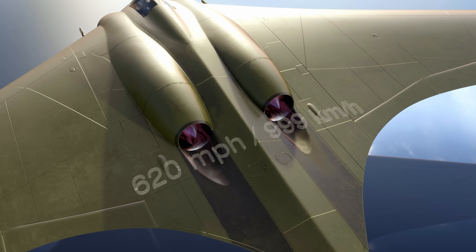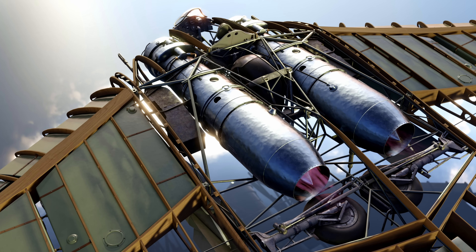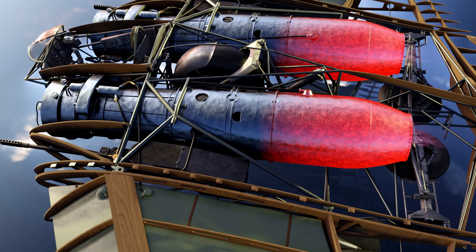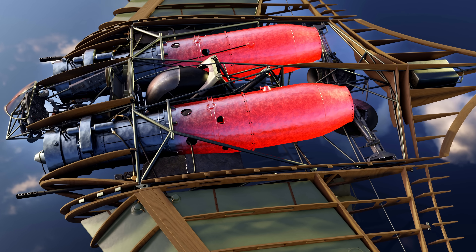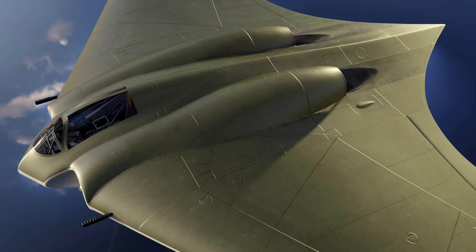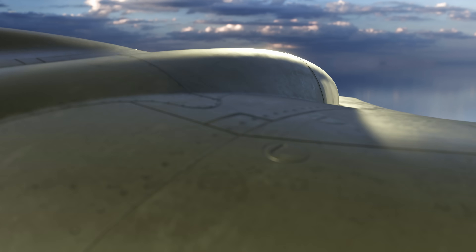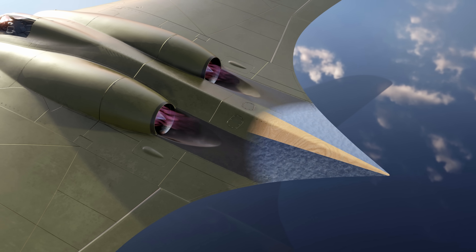But the aircraft's rapid pace came with a price. The engines were exceptionally fuel-hungry, and the high-speed performance of the engines led the turbine to be prone to overheating. By the end of the war, Germany couldn't source high-quality alloys, forcing them to utilize lower-quality steel in the engine turbines, reducing the engine's service life to approximately 20 hours of usage. The intake cowlings were made of metal panels hammered to fit over the plywood material on the leading edge. The exhaust panels were made from flat steel parts with a concave area, and metal panels protected the wooden structure of the plane.